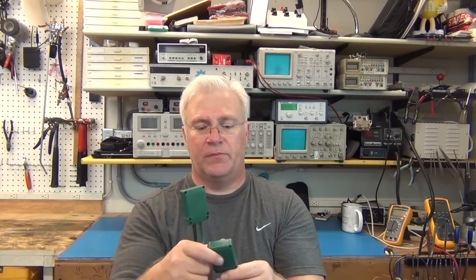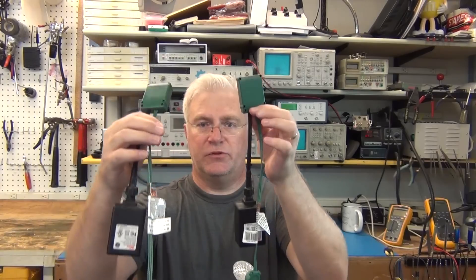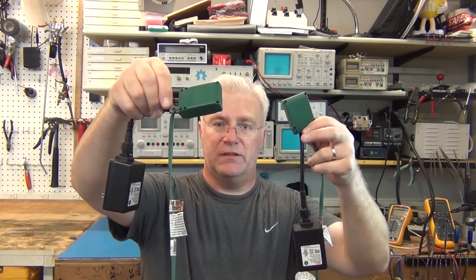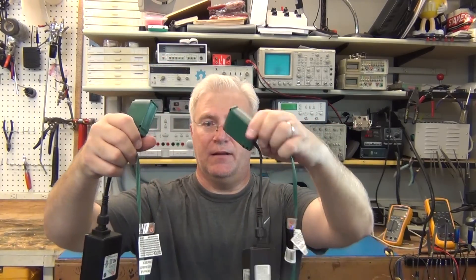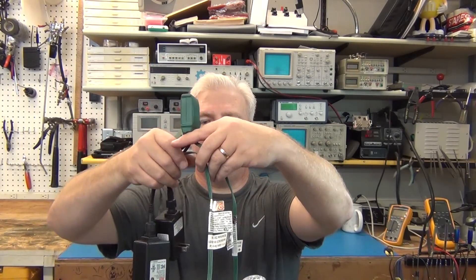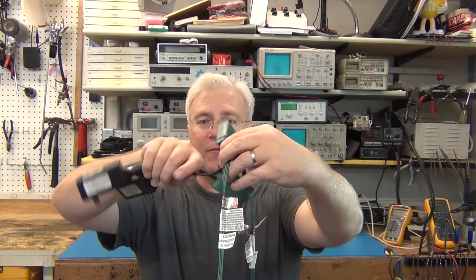The concept is pretty simple. I have two controllers with two power supplies. I'm going to take out one controller and hack into both strings together. Each line will be powered by its own power supply, but I will tie the grounds together so the power supplies share the ground, and I will tie the data signal together so that one control box has its data signal going to both strands.